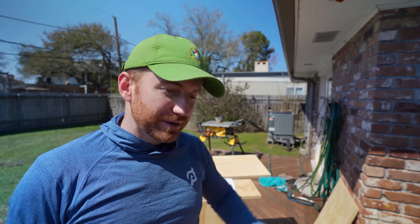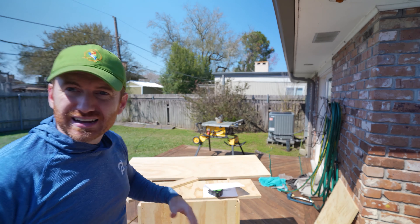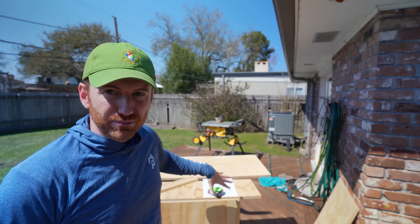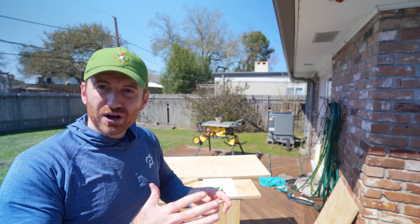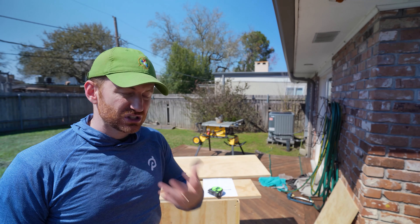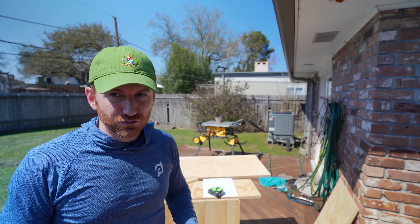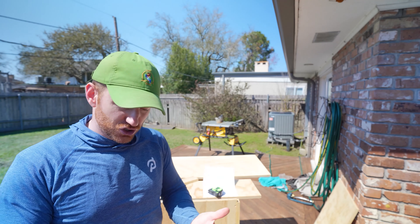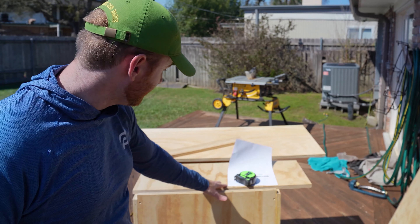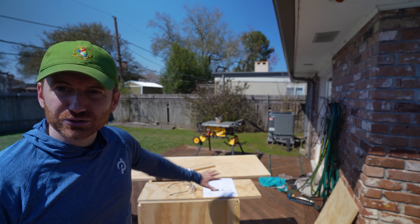At this point, if you had the big box store cut the wood for you, you'll be left with three scraps — one, two, and three — and that's what you use to make the brace on the inside. The downside of making your box this way is you don't have one clean sheet for the center support. With these three scraps there's an infinite number of ways to brace the box. I'm going to use the medium-size scrap, cut it to 22.5 inches, then rip it in half.